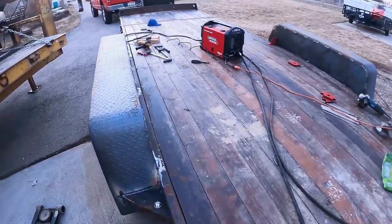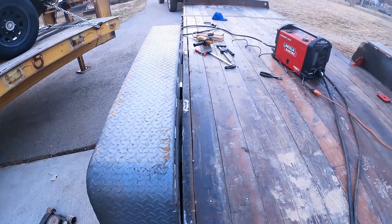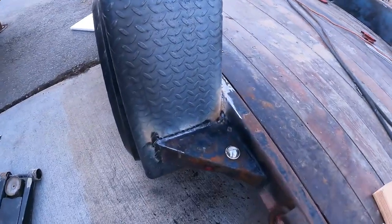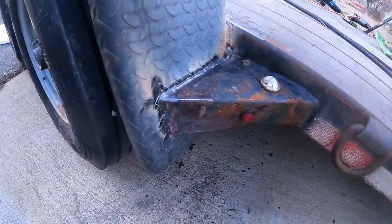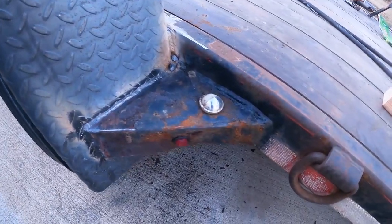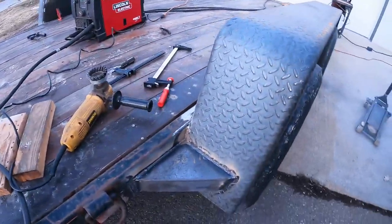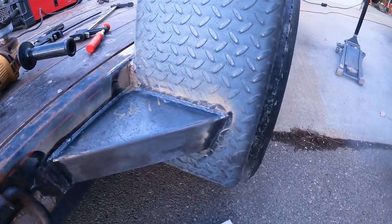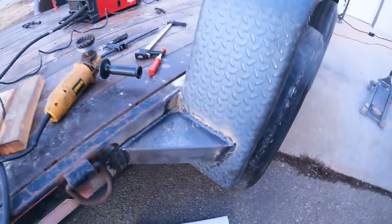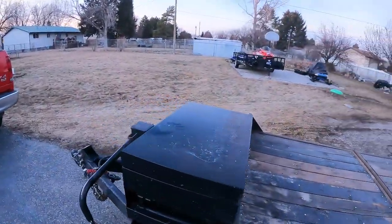Fenders are in. I still need to deal with that gap there, but I can do that in a little bit. The old gussets don't look very good — they're too thin and rusty, so they burn through a lot and the welds didn't turn out perfect. The new gusset turned out way better looking. It's thicker material and it's not rusting and getting thin.